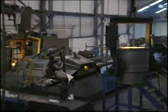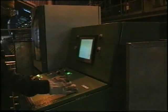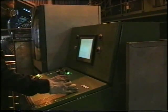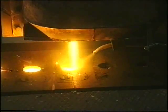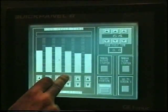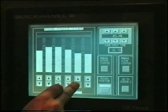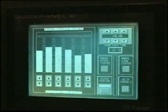Having filled the unit, let's look at the stopper control. You can pour manually using a joystick so that the stopper follows the position of the stick, and switch between auto and manual pouring at any time. The normal automatic mode is set from a touch-sensitive screen. The bars represent stopper height, which can be varied throughout the pour, while the time is adjusted on the edgewise switch at the top.